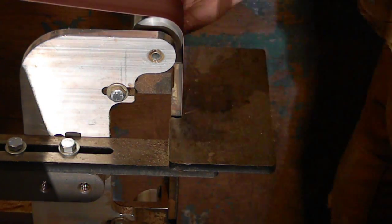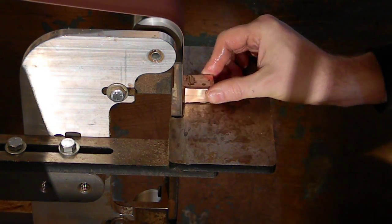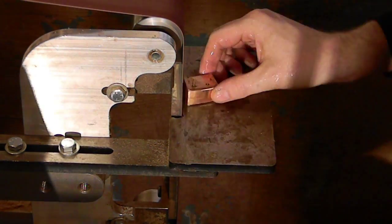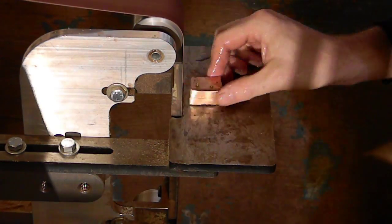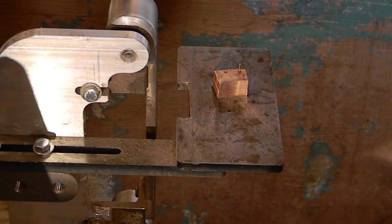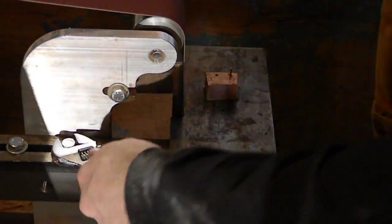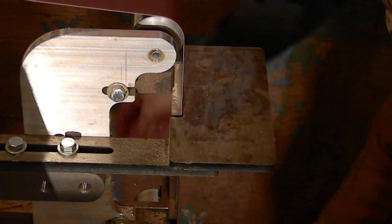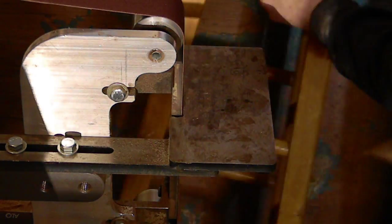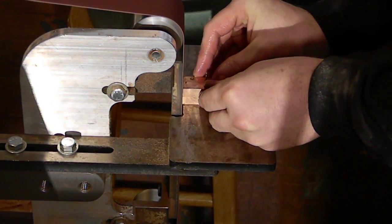All right, so they're starting to come together. You can kind of see the shape, and copper, obviously very, very pretty. I went down to a lower grit at this point, and we're just taking it easy. We're trying to get the curves in, making sure that it's going to fit right on the knife. Now, we haven't really had a chance to talk about that, but when you're finishing a blank like this Damascus blank, you're not going to be able to grind that blank. Otherwise, you're going to have to dip your blank back into an etching solution to get the gray color to come back out. So grinding the knife is not what you want to do, which means you need to take extra care in shaping your pieces before you apply them. So that's what we're doing.